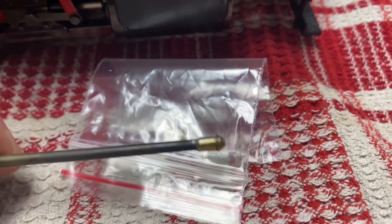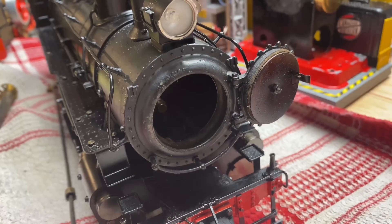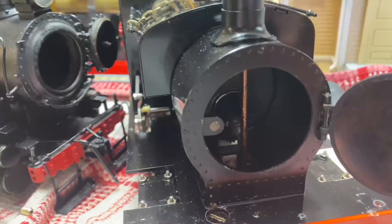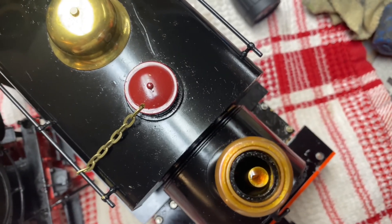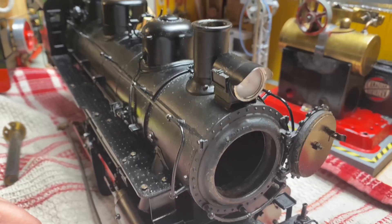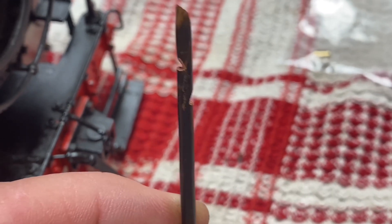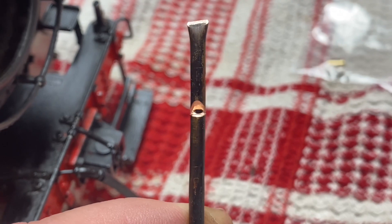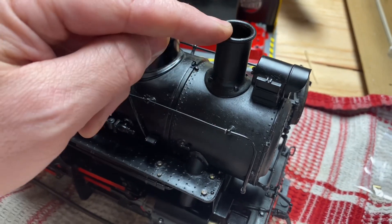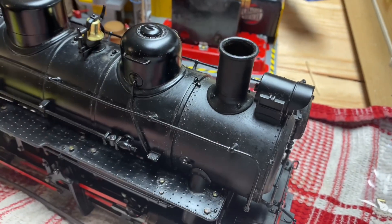My next problem is the original blast pipe — I had repurposed and cut it, so I don't have it anymore. That's no biggie because this has a Summerlands chuffer in it now. My Acucraft Sabrina still had its blast pipe, but in this engine the blast pipe doesn't fill the chimney near as much, and there's a large smokebox anyway with the opening in the bottom. Sabrina's blast pipe was so much longer that when I screwed it in it came up too far, so I cut it short to just below the top of the chimney and pinched the top. I decided to experiment with two holes — one added benefit is that the Summerlands chuffers blast the exhaust down into the smokebox, but this is going to blast the chuffs straight up the smokestack in a way that's a little more realistic.